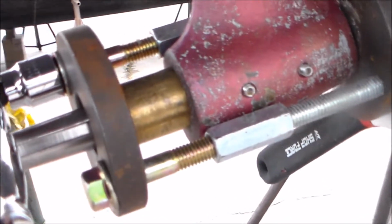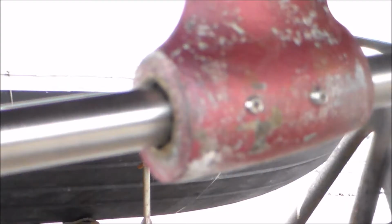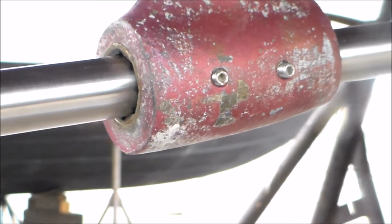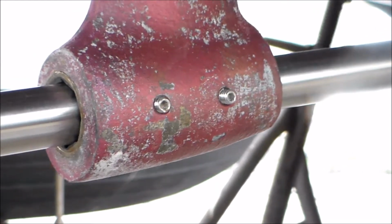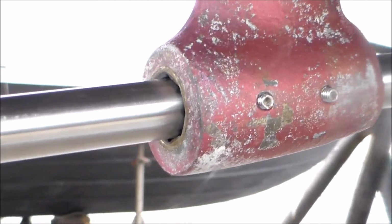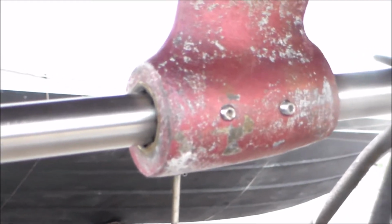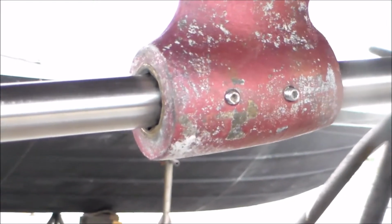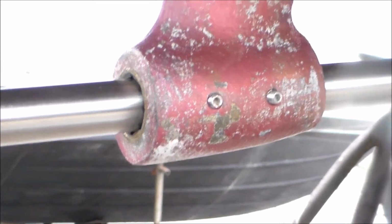It's hard to hold the camera and crank and watch at the same time. So let me put this down and finish cranking her in. The strut bearing is all pushed in right where we want it. We'll tighten up the set screws once we're all done with everything else, but now we move back into the cabin. I think we'll pack the stuffing box nut before we put it on the shaft, so we have to keep the shaft, you know, loose. And then once we have that packed and in place, then we'll tackle the coupling. So we'll see that on the inside.